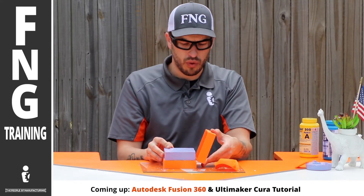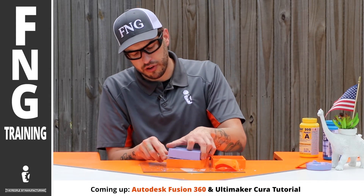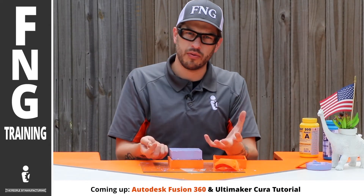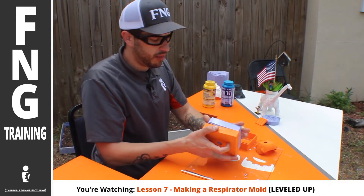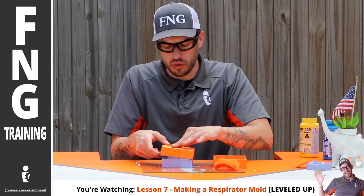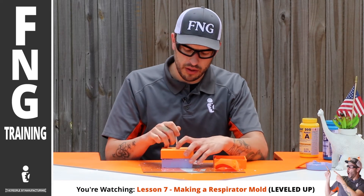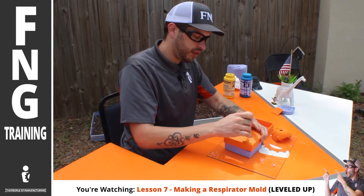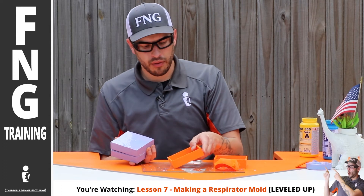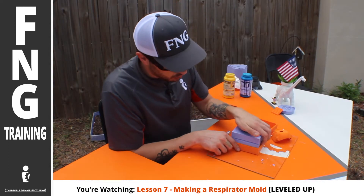It opens up and then it just rolls right out, exposing the top part of our mold. So I'm able to get those fine little last touches — those fine-tuned edges — cut them all out. Then I'm able to open this up to expose my 3D-printed orange mask. Now I'm going to flip this guy over and use those holes to really push down on this mold, because I need to flip it over to pour my material into. I'm getting all this set up before I mix my material.